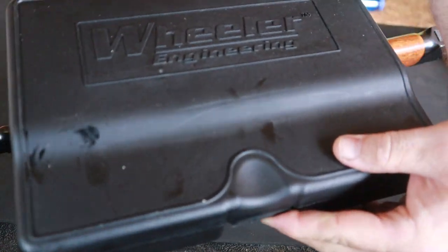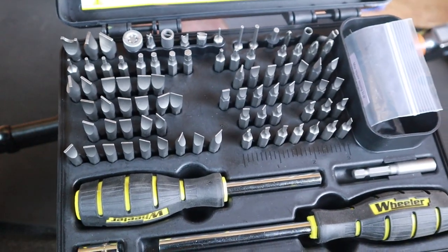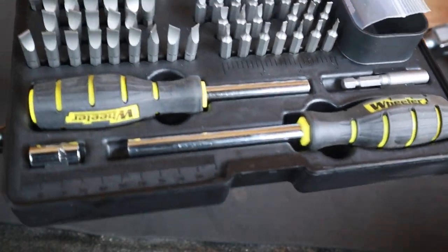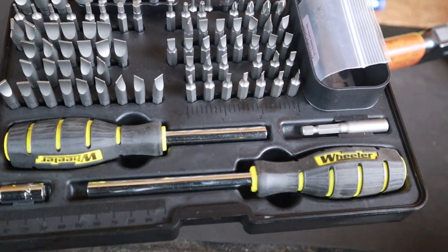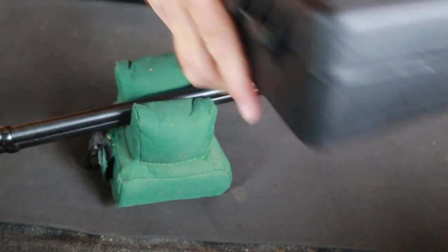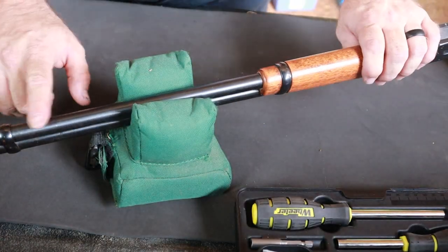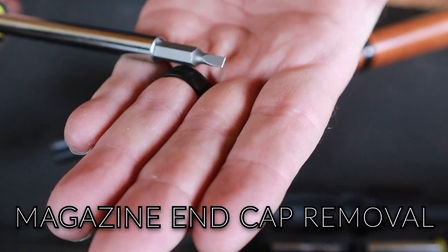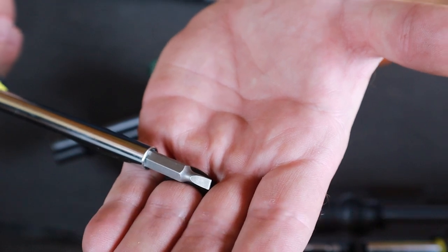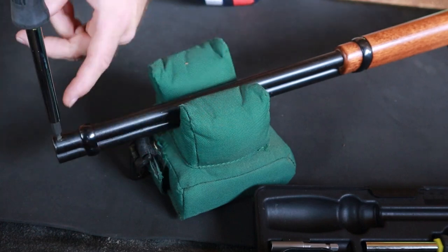Our second responsibility is to have the proper tools. I've been using regular screwdrivers for a while, but this Wheeler set — Ranger Point Precision makes no money saying anything about it — is super duper handy. The first thing we're going to do is remove the magazine end cap screw. I've selected the appropriate screw tip so we're not jumping out of that screw and boogering it all up, which would make the gun ugly and can possibly cause issues in the future.